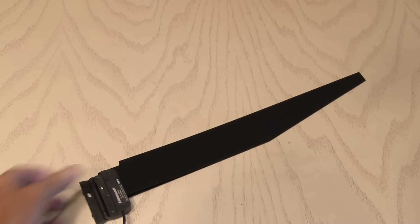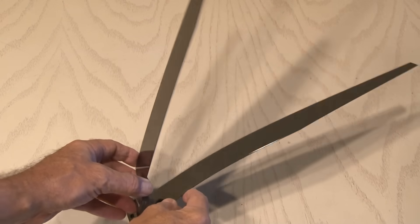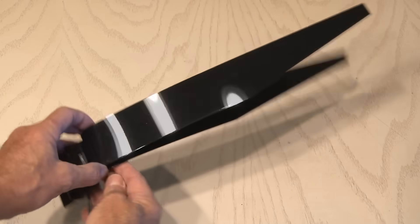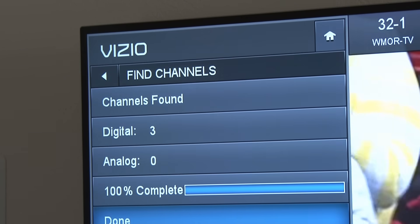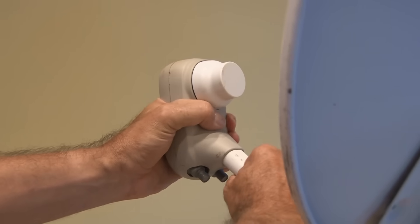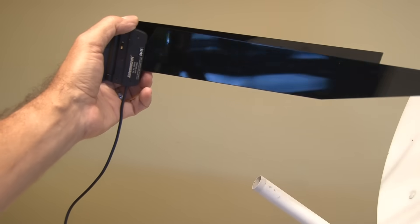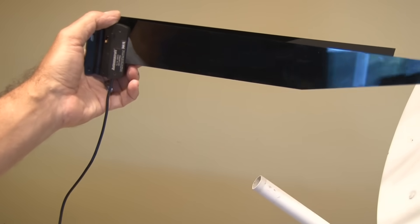I have this little over-the-air HD antenna as a backup in case my other sources of TV go down. But I gotta be honest, I put it outside and I was only able to grab three HD channels — a little disappointing, but what do you want for ten bucks? So it's time to turn this into a long-range HD TV grabber. Like all of these projects, it will require the removal of the LNB. In this case, we're going to mount this antenna facing into the dish so the dish can grab the signals and shoot them into the TV.